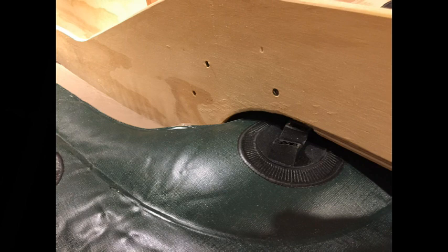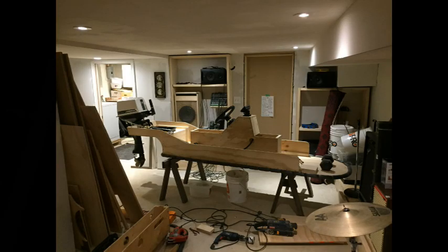The other issue I had — mostly because I didn't leave enough clearance for that overhanging transom — is that there are a couple of bonded-on motor mount provisions on the Intex Seahawk 4 that need to be cut away for clearance. Alternatively, you can raise the transom a little to include that clearance. I initially tried using the engine mount provision on the Seahawk 3, and it was awful — I had no faith in it whatsoever. Maybe for a very small trolling motor it would be adequate, but it was junk. So I just took it off with a Sawzall on the Seahawk 4.